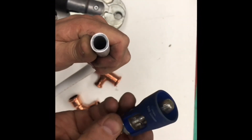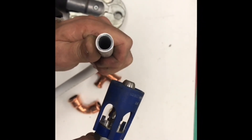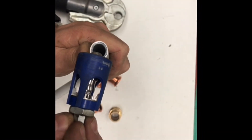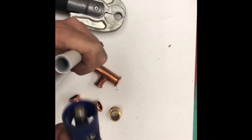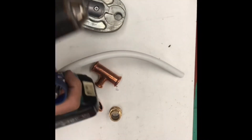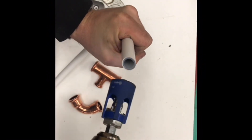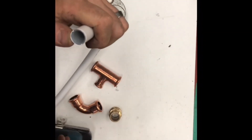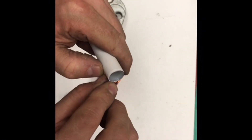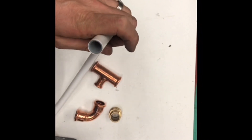This is a speed reamer. These come in different sizes and you need to be aware they are brand specific for the pipe, because the pipe can be a different wall thickness — the outside diameter will be the same but the inside diameter may not. All you're doing is reforming the pipe round and putting a small chamfer on the inside and chamfer on the outside.